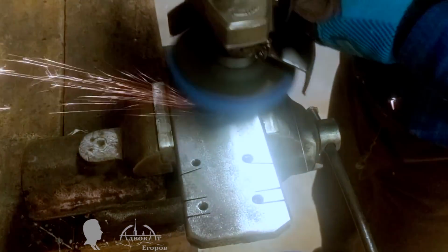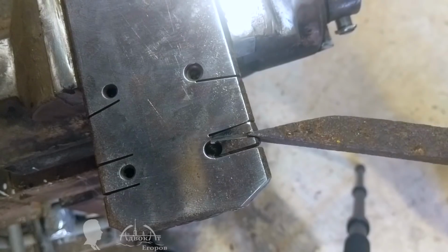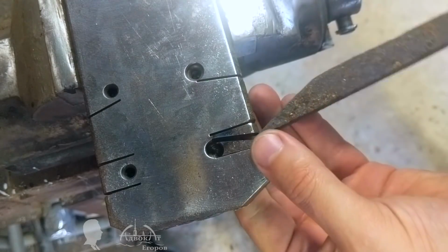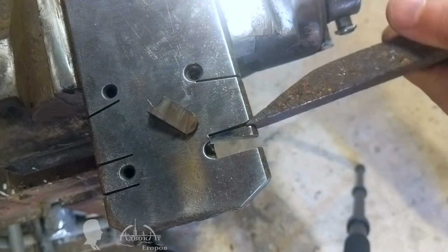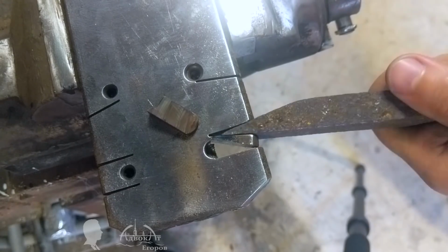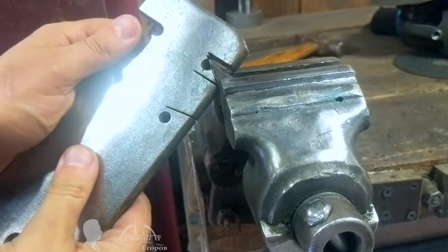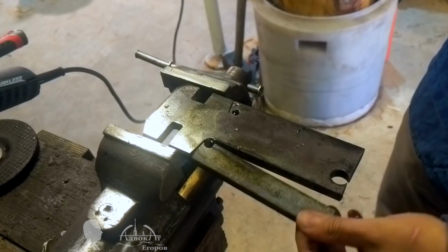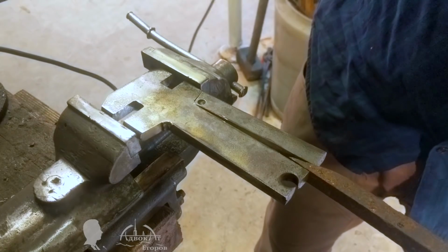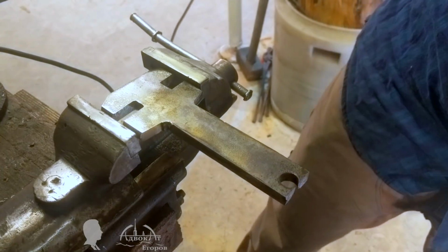So I got sidetracked again for making another auxiliary tool. Of course, it is a loss of pace, but on the other hand, a bending fork is an incredibly useful tool around the metal shop. The working part of the fork is made from a large leaf spring, and I probably should have annealed it first, but I figured I could drill 4 holes in the spring steel and my angle grinder's attachments could handle the hardened steel. Well, I did it, but it took longer than expected.